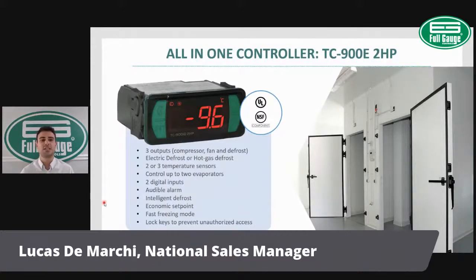Other salient features of the TC900E2HP include two digital inputs that can be used as a third sensor or door switch, and a built-in audible alarm that can sound high and low temperature alarms, door opening, and other unlikely events. We also have loaded an option which is commonly called adaptive defrost, which performs the defrost cycle only when needed, increasing performance of the refrigeration equipment and optimizing energy spending.